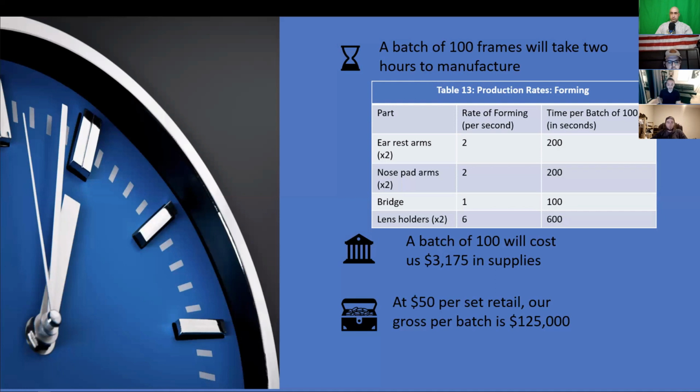Brazing would require a little bit more safety concerns on the other hand. Face and eye shields must be worn to protect from any sparking. Heat protection must be worn because with high temperatures involved with bonding the materials, we want to make sure employees are safe. We also, with high temperature and these materials that we're using, want to make sure that we have proper ventilation. So that's something that we've considered as well as far as our safety concerns.